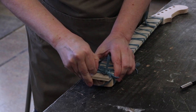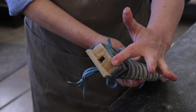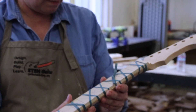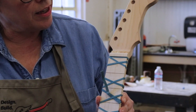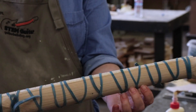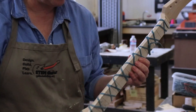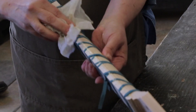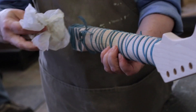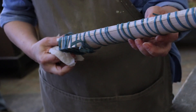Move some of the rubber band more toward the end to make sure it goes all the way to the end of the fretboard. Before you walk away, check: is it on the index line? Yes. Is it evenly spaced all the way down? Yes. Does it go all the way to both ends? Yes. A little excess glue at the edges is actually a good sign — it means the glue has reached all the way to the edges. We'll use cabinet scrapers tomorrow to remove any excess.